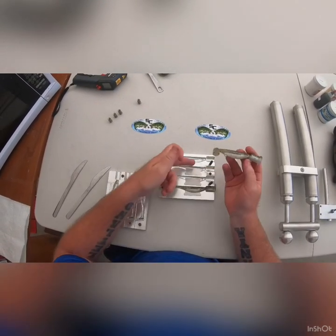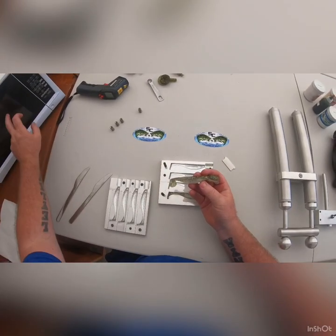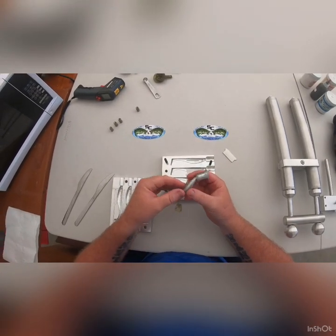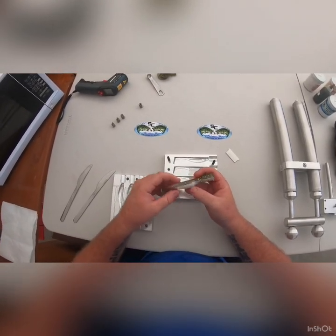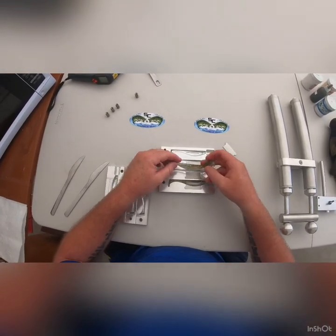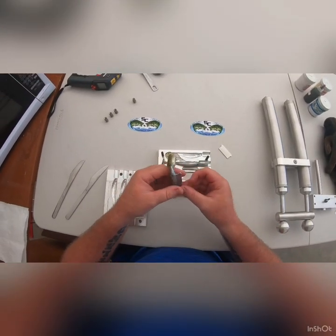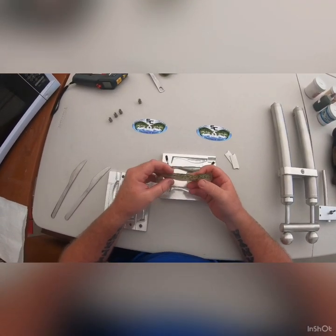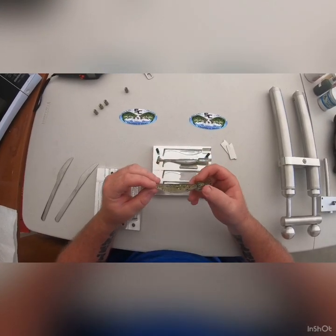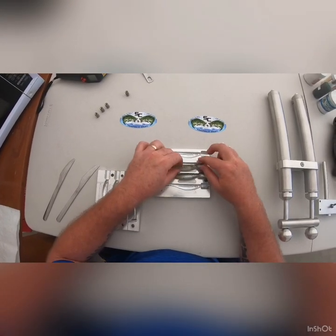I'm putting that down to the molds not being hot enough at the moment. Maybe also because the two jugs of plastic are not at the right temperature together. They need to be pretty much exactly the same temperature. But it's all handmade, guys. It's not machine made, so I sort of like it. It's not an error, it's just a little bit different effect, which is fine by me.